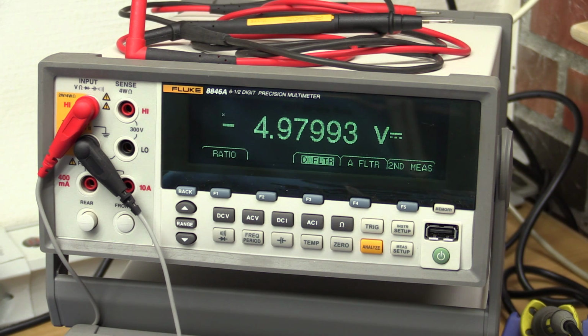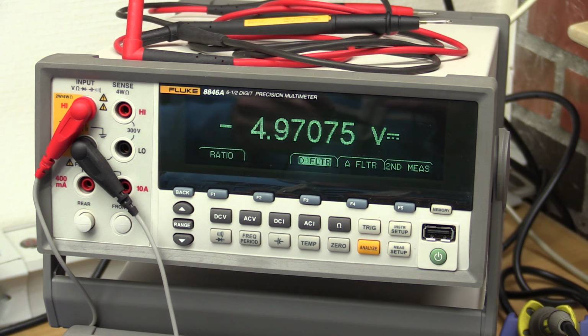So we are just at the maximum current now, and I am drawing 50 milliamps, and there's no way my op amp is going to draw that much current. But still, we're not quite safe yet, because we don't know what will happen when I hook up the 12 volt rail. So let me try and do that. And this is with half an amp of load on that rail, and that is never going to draw that much either.